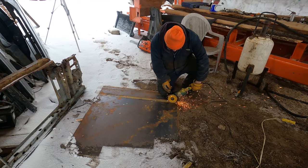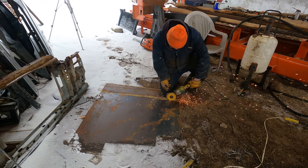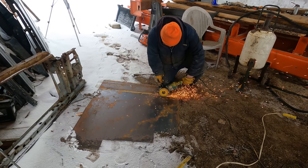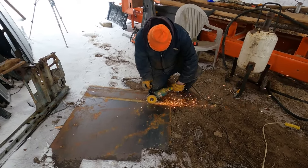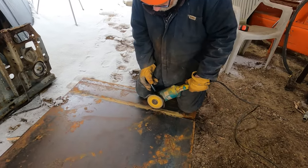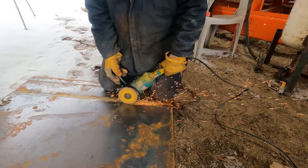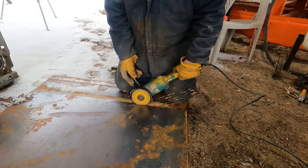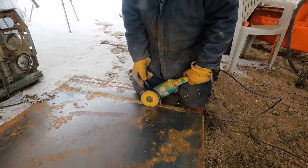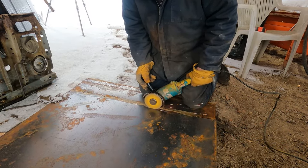in with the paint. And a lot of times I wouldn't even thin it using Varisol or acetone or paint thinner. I would actually take an electric hot plate, and I would put some water in a pot on the hot plate, and I would open up the can of the paint, and I would set that paint can in there, and I would heat it up sitting inside that water, and that's how I would paint the vehicles. I would let the paint thin out enough. I wouldn't need thinner. It thins out when it gets hot, right?